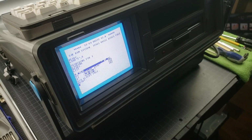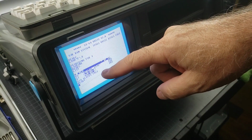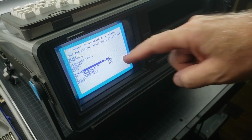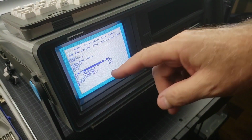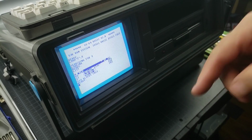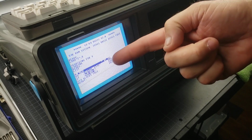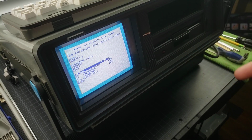Okay, so those were our two files that we had, mem dump and rom dump, but then see how it wrote kernel space 1541. So this holds two ROMs. It holds the kernel ROM, and it holds the 1541 ROM that are currently active. So you'd have to split this file up into two to get the two ROMs out of it.